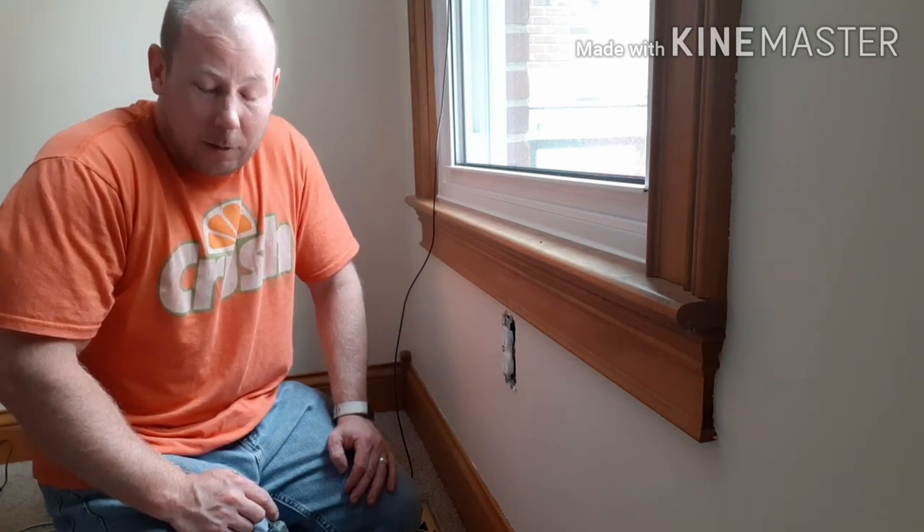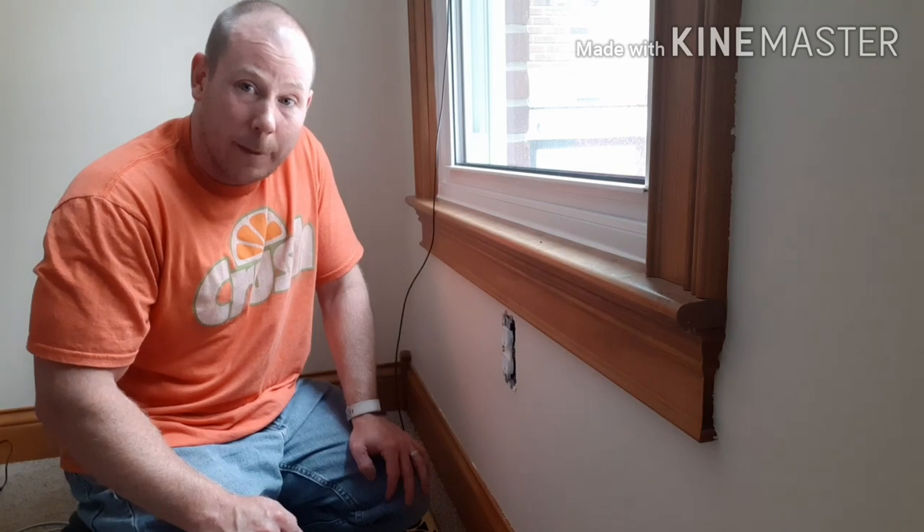That's it for this one — even with the demonstration it was under 10 minutes. I actually have seven more to do in this room. I'm going to do this whole room at once and then turn the power back on, which I don't necessarily always recommend because then you never know which one you did wrong until you check them all. I also recommend if you're new to this, don't screw it all the way back in before you turn the power back on. That way you can take a look behind it to see if anything's not going well. If everything was right but something trips when you turn the power on, you'll likely know it's grounding out — meaning one of the wires is touching something it shouldn't. It shouldn't be too hard to open them back up, move the wires around, and make sure you've got it right.